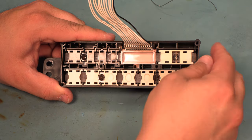But the basic process is that we'll heat the pad where we put the solder. We'll place the transistor so that one leg is above each of the three pads, and then we'll remove the heat and the component will stick in place. After that, we can apply a small amount of solder to each of the other two pads to finish the connections. And we'll repeat that process for each of the other transistors.